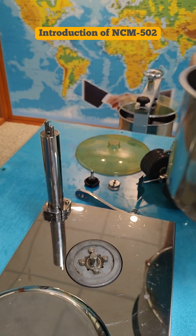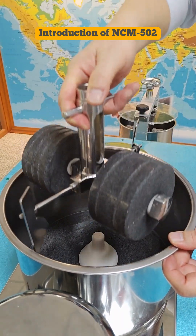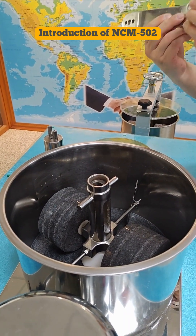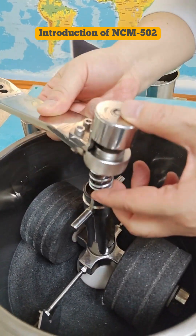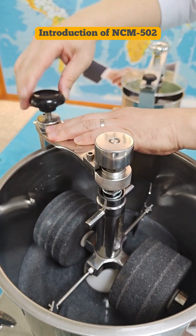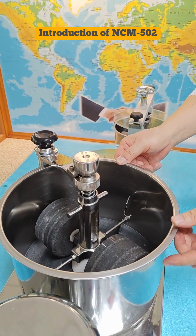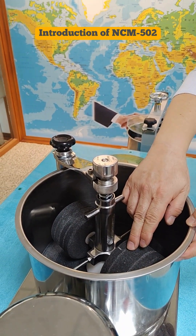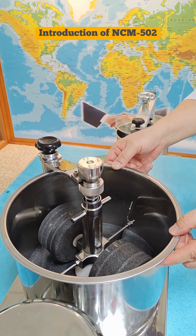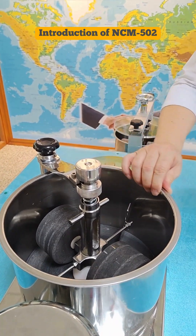Now we put everything back. Put the container on the rotation drive set, place the stone and fix it on the base, then slip the bolt into the oblong hole. After you put everything back, make a quick test. Rotate the container — the container will drive the stone rolling and it should be quiet. If any noise occurs, it can be caused by a loose part, so check all parts to ensure they are fixed well, and make a test again until it is normal.